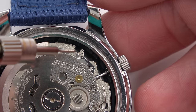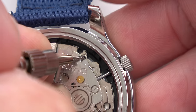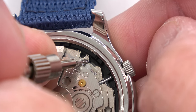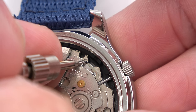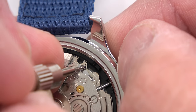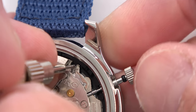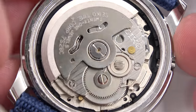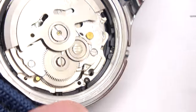So what you're going to do: take any kind of small tool — a screwdriver — very lightly. Remember, things on this scale are so fragile. Even though they're metallic, this metal is maybe ten-thousandths of an inch thick. It's all very small stuff, so force is not the name of the game here. You're just going to touch it and push — very slightly — and then the stem's going to come right out. Now you can go ahead and knock it over, take the movement out, and do whatever you want to do.